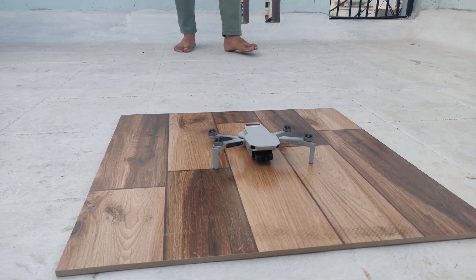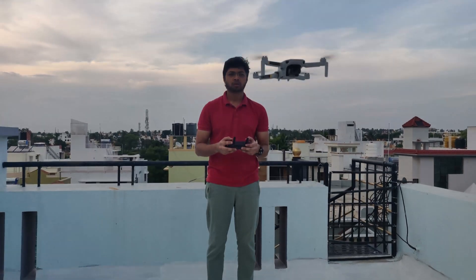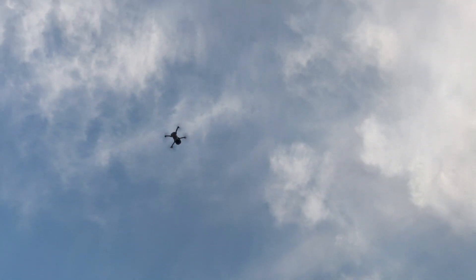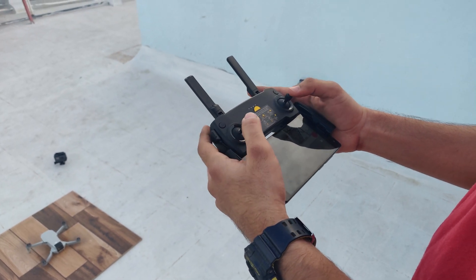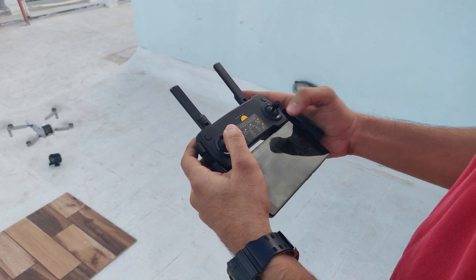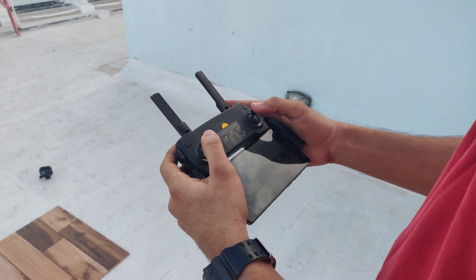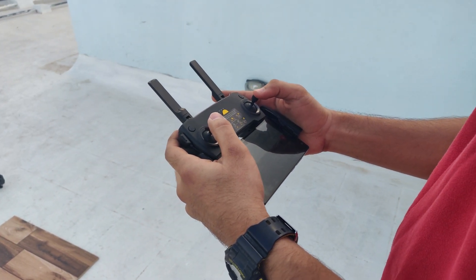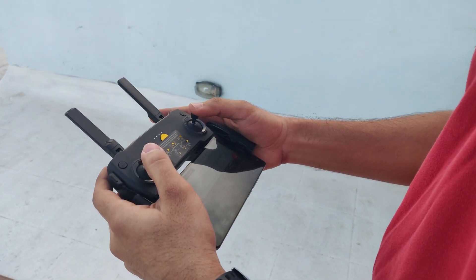I want to introduce some safety features — return to launch, or return to home (RTH). It's always recommended to launch the drone once it gets a strong GPS lock. RTH is also activated during low battery: when the intelligent flight battery is depleted to a point where it's safe to come back home, the app displays a low battery warning. It automatically returns to the home point if no action is taken after a 10-second countdown, and the user may bypass this by clicking RTH. There is also a 'Find My Drone' option in the app in case the drone landed somewhere and couldn't make it home.